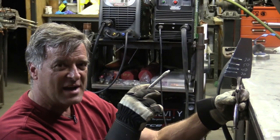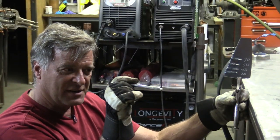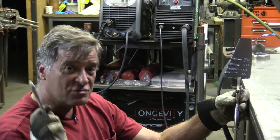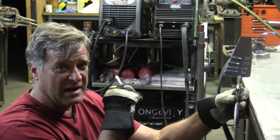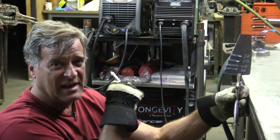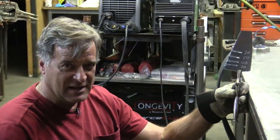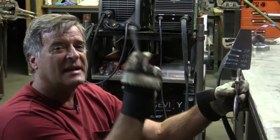It's not really so much amperage — as long as you have enough amperage to go through your metal and cut at a decent rate without barely inching along to get the cut to go through. But it's air pressure. Turn up that air pressure a little bit more. Read your manual — don't over-pressure the machine. They're only set to go so high. I think 70 PSI is maybe the highest this one can go without blowing a hose off inside the machine. Read your manual — it'll give you a range, like 40 to 70 or 30 to 90. It'll say right in the manual. It's more about air pressure than amperage.